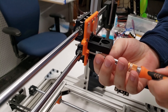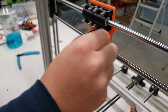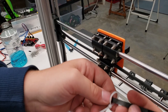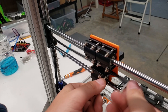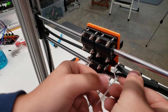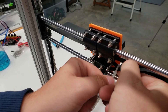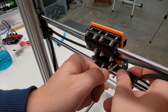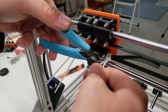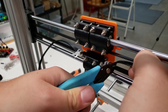Insert a couple of screws into the carriage assembly — these will hold the belt. Put a couple of nuts on to hold the screws in place. Then wrap the belt around the entire carriage, looping it all the way around. At the screw end, overlap the belt onto itself and fasten with a zip tie — use two zip ties with the teeth touching each other to keep it from moving. Once one side is done, do the other, then clean up your zip ties and clip off any excess belt so it doesn't get caught in the carriage assembly.